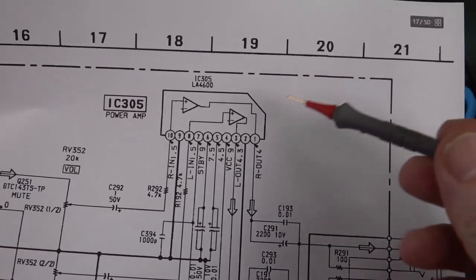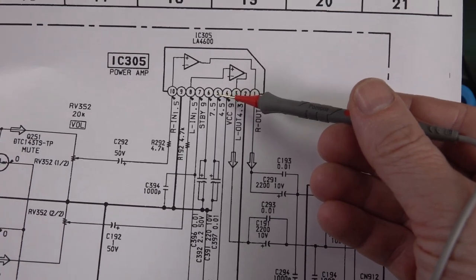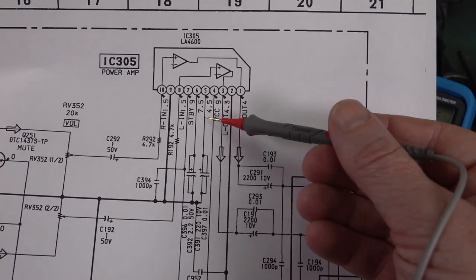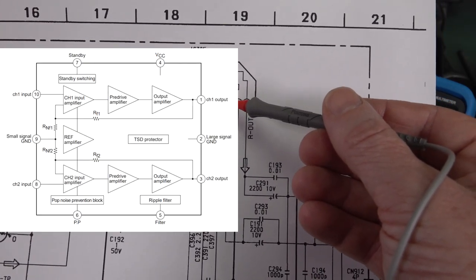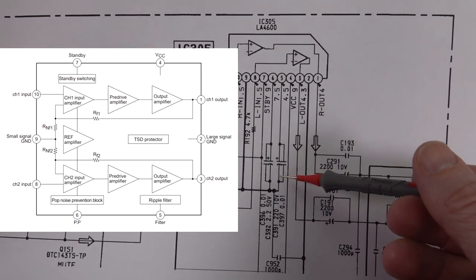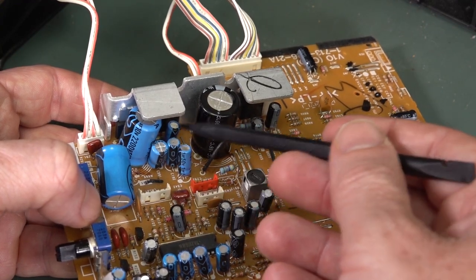We're looking at pin 5, which is one of the filter pins — it's just got a couple of caps on there. It could be one of those. Once again we're fine, and we switch it on. It's drawing 11 watts, drawing 1.2 amps. Pin 5 should be 4.5 volts — we're getting 5 volts. Our next pin should be 7.5 volts — we're getting 4.2 volts. Both of these voltages are off. This one's grossly low. If one of these fails, maybe it's just not going to be stable anymore. These voltages are being generated internally. So we've come a gutter right there — right off the bat you'd want to be checking those two caps, C391 and C392. They look okay but they could be dead as a dodo.